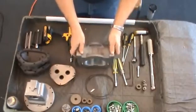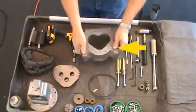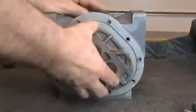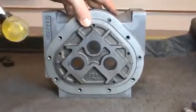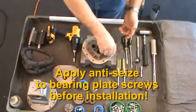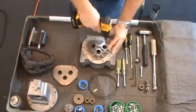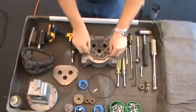The meter is now completely disassembled. To assemble the meter, make sure the back side of the housing is facing you. The inlet side of the meter housing with the name plate will be to your left. Begin by installing the rear bearing plate. With the flat surface facing the meter cavity, align the plate with the dowel pins on the housing and press into place. Gently tap the bearing plate into position with a plastic hammer until it is firmly seated in the meter housing. Apply anti-seize compound to the threads of each of the 5/16ths bearing plate screws. Half tighten the screws in a criss-cross pattern, then torque the screws per the chart in the manual in the same criss-cross pattern to secure the bearing plate.